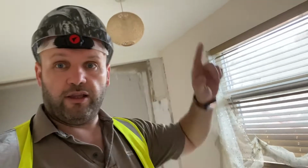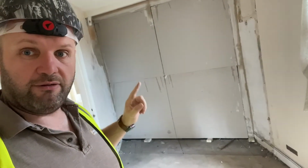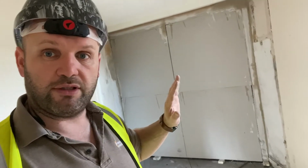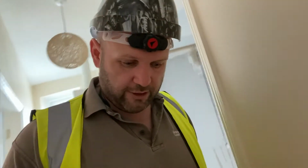Now it's not to say that they might not get a little bit along here, but that's a massive outside facing wall, and it's obviously already got existing issues, so that's why we've chosen to do it now. We weren't instructed to do this, and we've recommended that they do all the external walls with the insulated plasterboard, but the funds, the moolah, doesn't allow it. So we've done what we feel is the worst parts to try and prevent the problem. So we've solved some problems there, folks. Take me word for it.